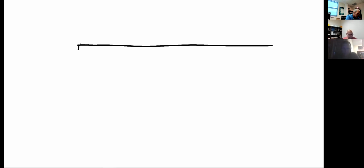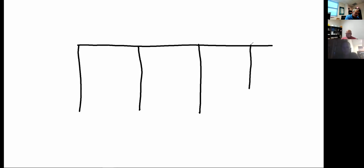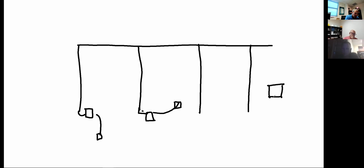One last thing before we take our break here, something I've forgotten. I'm going to draw some poles right here. Here's my overhead line. And I'm going to draw a pad mount transformer down here, and draw some secondaries off to the side here. Another pad mount, secondaries over here, whatnot. Guys, the locator, the wand itself, cannot discriminate in direction.